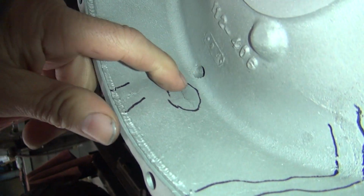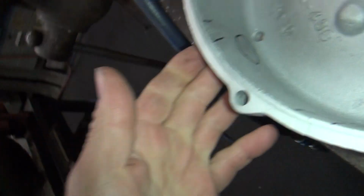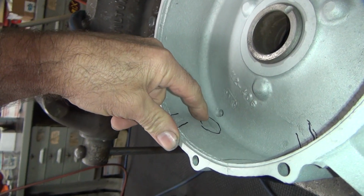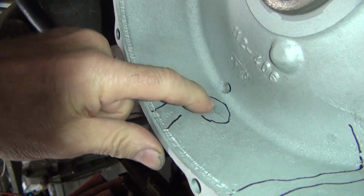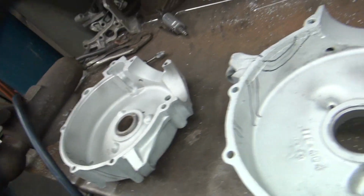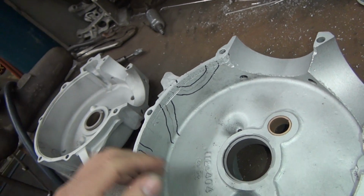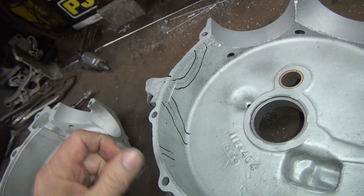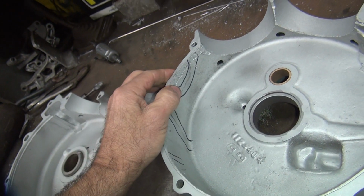So I've given you these big cracks like this. You would peen it right here around where you welded it, and if you hit it too hard, it does this on the inside. It spider webs it, everything. So you got to V that all out and re-weld all that. So it kind of defeats the purpose of doing it. So you got to be careful. So anyway, that's what we got to do. So I'm going to figure out how we're going to do this.